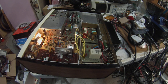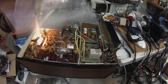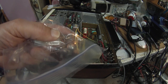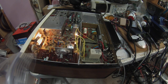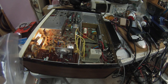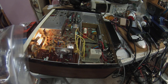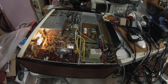Allison suggested converting this board to the LED version, which also means changing some resistors. I decided not to do that; instead I managed to find a panel meter exactly like the one installed in here, and here's that unit right here. My plan is to drill a little hole in the back of the case and mount the grain-of-wheat lamp there. There are only two little metal brackets with a single bolt each — loosen those and I can pull the panel meter out, then drill the hole and install the grain-of-wheat in the corner. This way I retain the original meter and the mod is fully reversible.